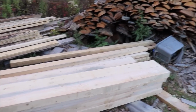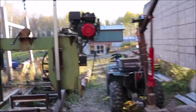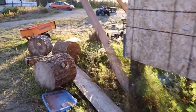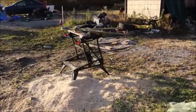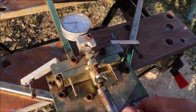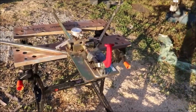And we got this all milled, and I sharpened up a blade and I did the saw set on it, and I'll show you what I used. Heather, how would you like to wheel the mill back, and cover it up and jam that stick in there so it don't roll away. I've had this for quite a while. Morris, a fella I know, gave this to me, and it comes in real handy. This here I use for setting the teeth on the blades of the mill. It's a proper one for setting the set on the blades. Then I have the sharpener in the basement, but I bring this out each time I need it. Makes a big difference when you get the set back in those teeth where they're supposed to be.